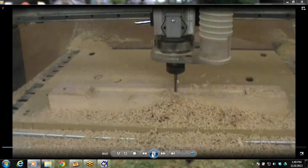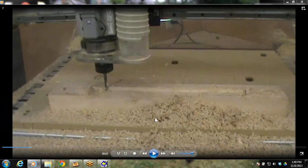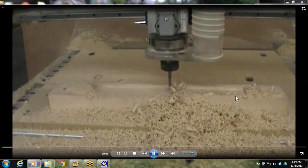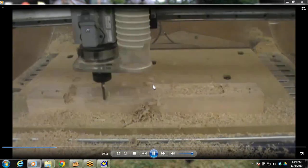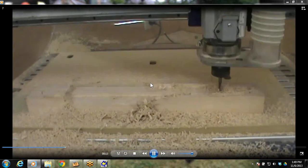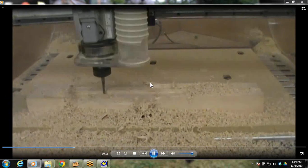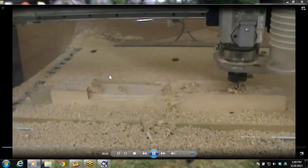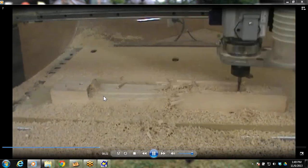Now notice one thing here. What did I say earlier? This board in this example, when I filmed this, wasn't the full 3.5 inches wide. It was 2, just wider than the part. And note my bit will be sticking out over here. Sometimes when it's making a really aggressive cut, see these chips and chunks over here in the end, this blowout? You won't get that with a wider board. So that's where it's nice to have a wider board than having that bit hang out on the end there.